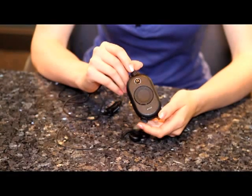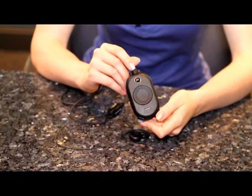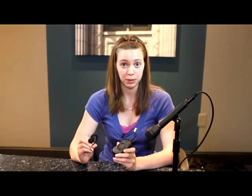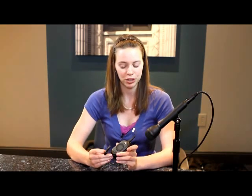It's also very easy to program manually. This radio does not have an external speaker, so you can listen to the voice prompts through the earpiece. First, you have to make sure the earpiece is connected. To do so, always have the radio turned off, then firmly secure and screw in the earpiece. When you turn the radio on, you know it's working properly when you hear the chirp out of the earpiece.